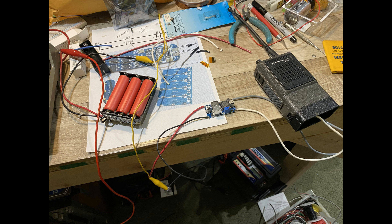Before I got too far, I thought it might be prudent to do a little live test. Here you can see I connected our new battery pack through the buck-boost converter, through that little part I harvested from the old Motorola battery pack, into the radio — and it all worked just as expected. So that's pretty cool. One thing I did notice, though, is that the major power handling component on the buck-boost converter did get a little warm.